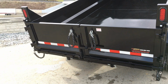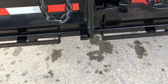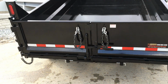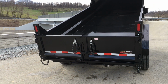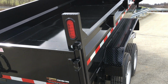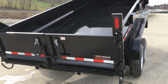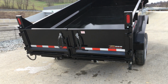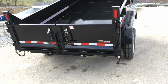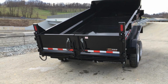They do a combo spreader door, undermount ramps. Notice the ramps will adjust almost the full width of the trailer. Short Trac uses all LED lights with a sealed wiring harness ran in frame. One of the nice benefits, these LED lights you see at the back are kept up about eyeball level of somebody that's in a car instead of being tucked underneath like you often see, which just makes them harder to see, especially for anybody that's in a taller vehicle or a truck.